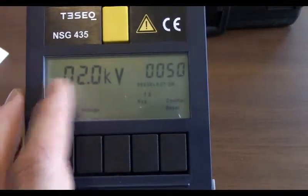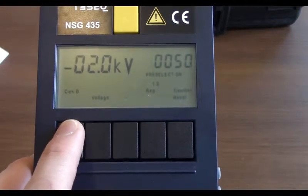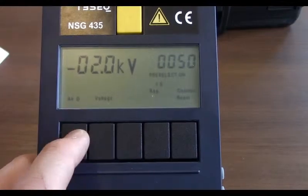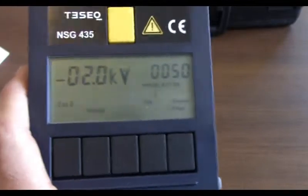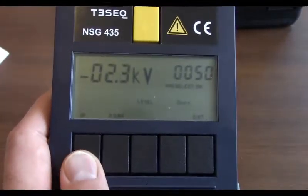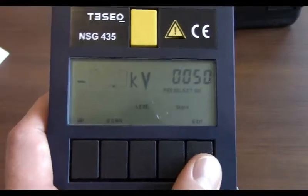Right here you'll see your voltage. Working from the left to the right, this determines the contact or air discharge — so right there you'll see 'air,' and then you'll see 'contact.' We've got the safety on there. So you have your contact discharge right there. We're going to click on the next one, which says voltage — and just like it says, it changes the voltage. You can go up; we're at 3 kV. We're satisfied, that's where we want to test, so we're going to hit exit.